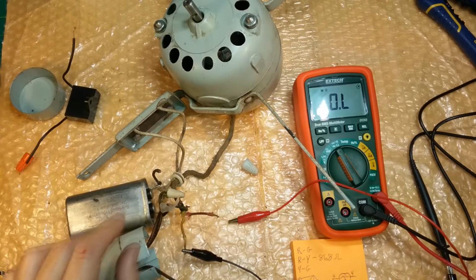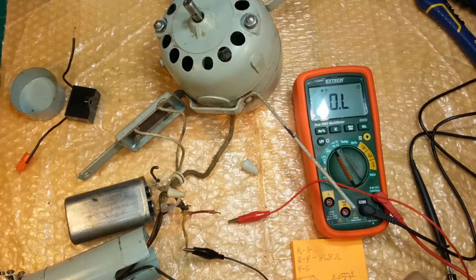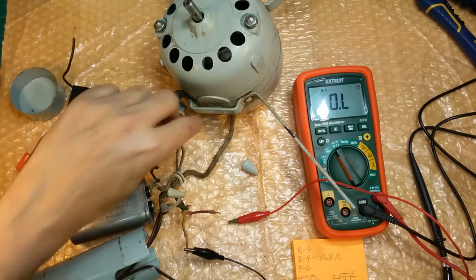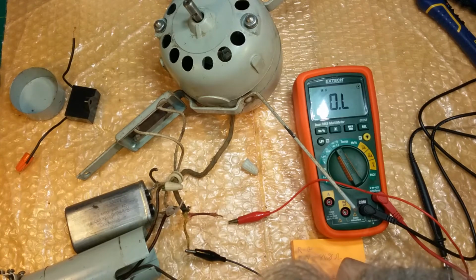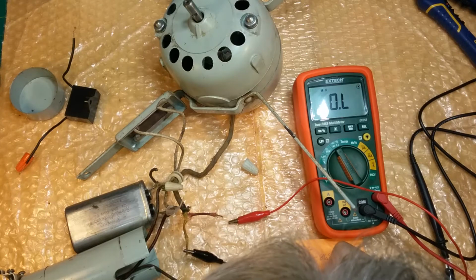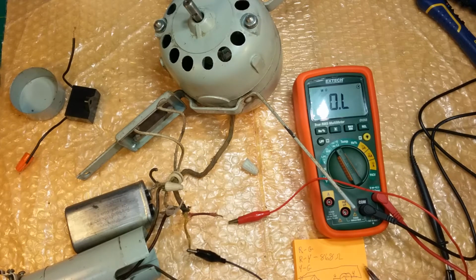Okay, now, the red wire, which we stripped, connected to the other side of the capacitor, so it came across here and connected to there. So the capacitor is in parallel across this coil, or this connection to the motor stator. The other side of the resistor comes out and goes to number 1, which makes sense, right? Because it adds resistance in the line. It connects to number 1. So high, or straight in, and the yellow wire goes right to the other side of the plug. So I probably should have drawn that wire over there. I'm just going to come out this way. This one goes right to the motor, connects to the yellow wire.